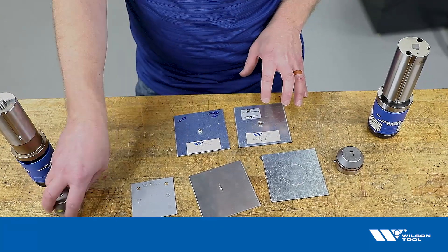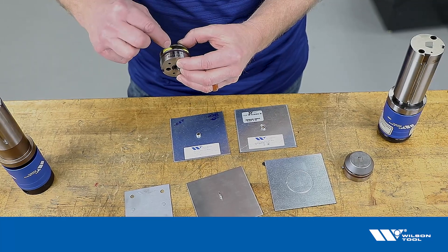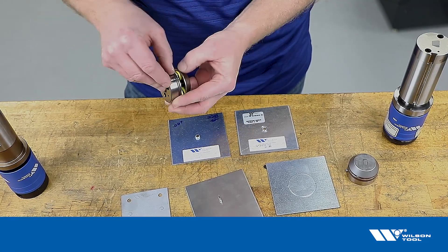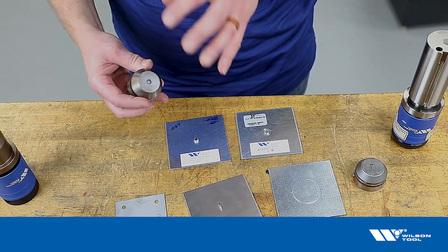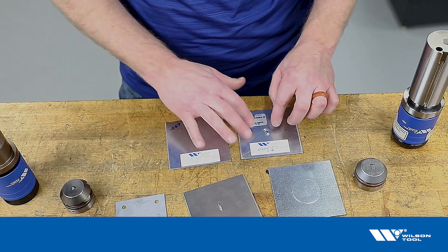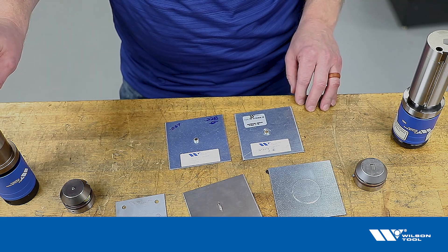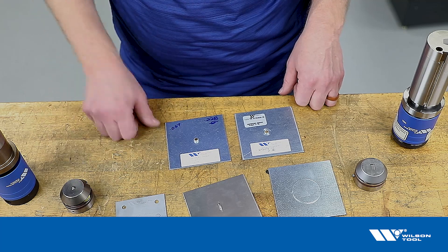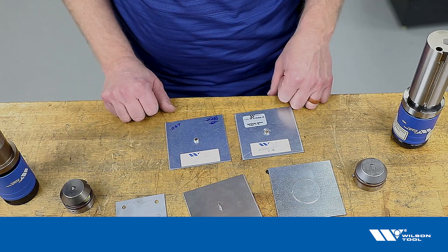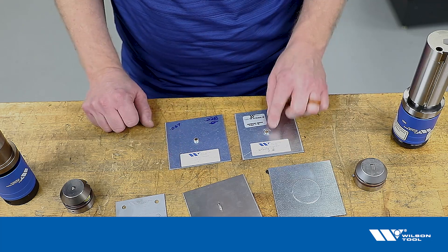What happens is when the extrusion tool is stroked all the way, the cap comes down and hits — those two surfaces touch, the tool can't travel anymore, and now we start to build some pressure on the surface of the metal. That's where the witness mark comes from: the face of the punch starts to press against the cap of the die, you get some compression, and that creates that witness mark or pressure mark on the metal.